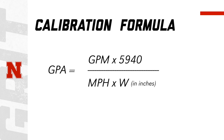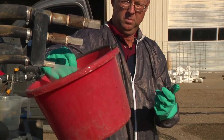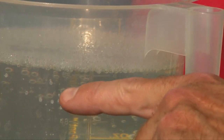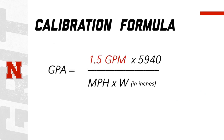We have caught the spray mixture — water in this particular instance — for 20 seconds. Measuring it out in fluid ounces, it is 64 ounces per 20 seconds. If you take that times three, you come up with 192 ounces, and if you divide that by 128 you come up with 1.5 gallons per minute. That's what we need for our gallons per acre formula.